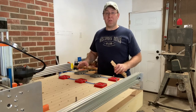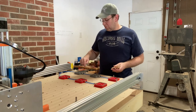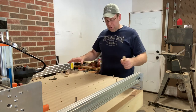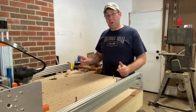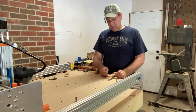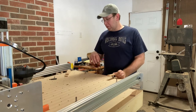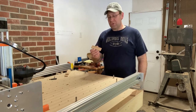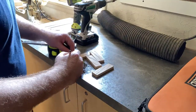Here's another feature that comes into play — we can use the locating pins with the pods, but we can also use the locating pins as clamps. With the pods removed, I can take a piece of material and butt it up next to the locating pins. I can also take a piece of wood, drill a hole, bolt it to the pin, and when it retracts it clamps down. I'm going to set it to 100 psi and see if that's enough.